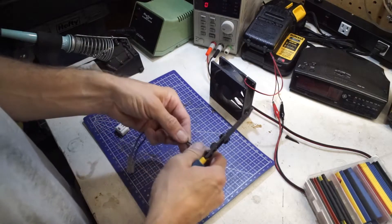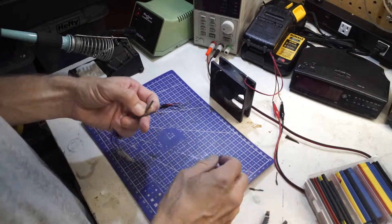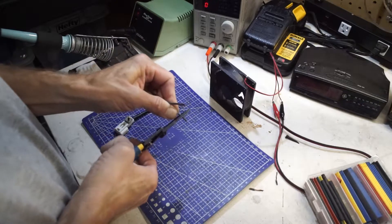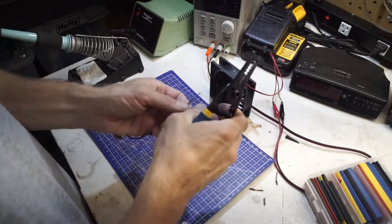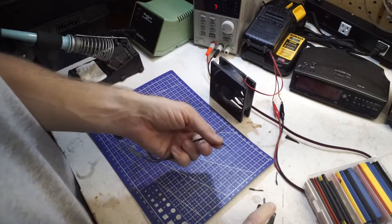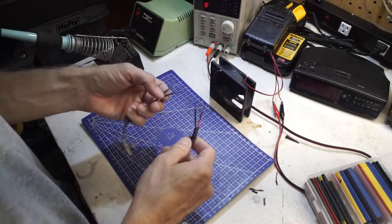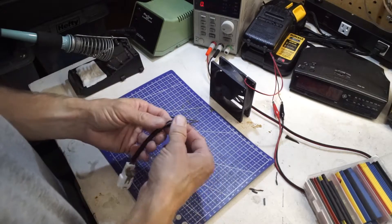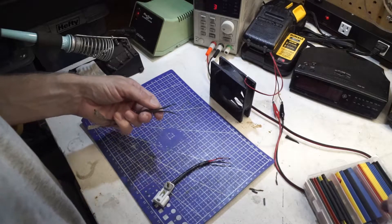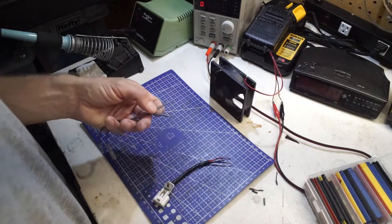I think I'm going to end up cutting these off and just start fresh with some clean wire. You don't really need a nice pair of wire strippers — you can do most of the stuff with a pocket knife — but you will need a soldering iron. You can find those super cheap on Amazon or AliExpress for less than 10 bucks. There are a lot of different ways people connect wires, but as long as you get them soldered together in line and get something covering them — heat shrink is ideal, tape is all right — but the point is: solder them together, don't just twist them together.